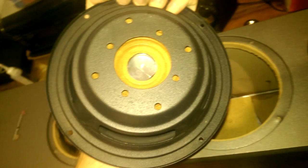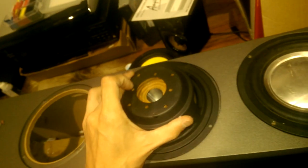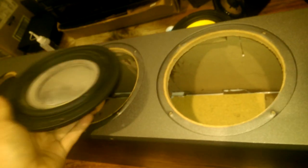And here's the passive radiator. It'll pop you out — no weight. As you heard in the other video, the one I worked on already has a lot more bass. I took the passive radiator because, as it is at the moment, it's tuned to about 80 hertz, so it sounds really shitty. Now I added 45 grams of weight to the other one to weight it down nicely, and that gives it a much lower tuning frequency.